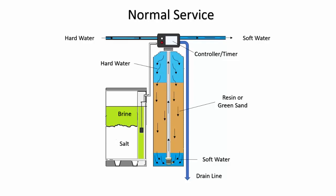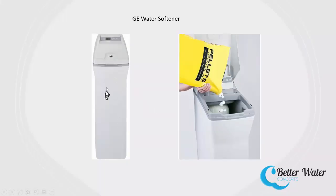A picture of a water softener shows two separate tanks, but most water softeners for a house are actually one tank. You've got the brains and the fancy control valve — the magic control valve — in the back. You've got the plastic tub that is the brine tank, and inside is the resin tank where the zeolite or green sand or resin beads are housed. It's a self-contained unit. If you get a really big softener for an industrial application, then you would have two separate tanks, but you don't need that in a home.